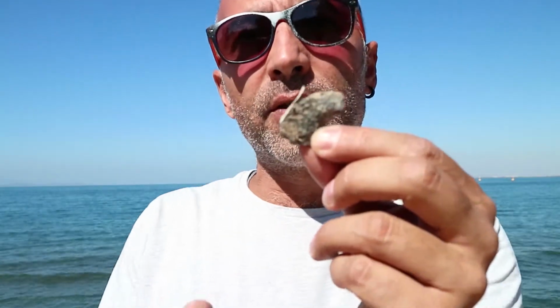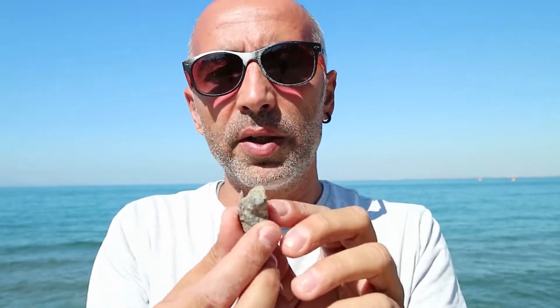Okay, let's say this is a piece of mosaic tile, and you put some glue on your tile and press it onto your mesh. What happens is the glue material gets onto that surface and covers it. So that means when you install your mosaic mesh in the pool, the thinset doesn't have a chance to reach the tile because it's already covered with glue material. You know what I'm saying? And glue material is actually shiny. It doesn't come into contact, in a chemical way, with the thinset. So the tiles are actually not glued.